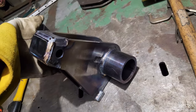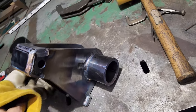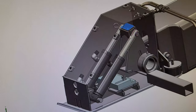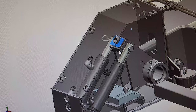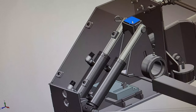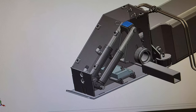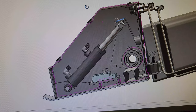It's hot. The rams have four inches of stroke, so I'll figure it all the way to there. Here is the solid model of the rear hydraulic box. You can see this part here with the torsion bars going through there, and then the rams are going to be extending. We always want to extend for the power stroke — there's less power on retraction — so we're extending to lift the bus. I have this stuff kind of transparent right now, but you get the idea of what we're working with.